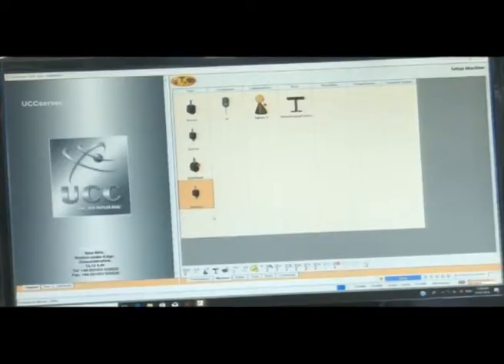The purpose of the UCC is to permit control of the CMM from the front-end software, providing control signals to the CMM probe system. UCC features include: data transfer and control, communication with the controller, CMM measuring accuracy enhancement, measurement coordinate systems, digitizing and scanning abilities, and data filtering. We can also produce files in IGS format, which generates a lot of codes encoding geometric shape information. Data can also be exported in Excel format.